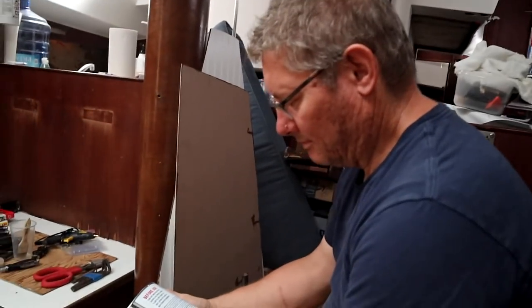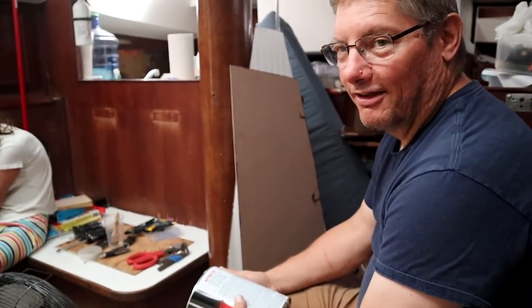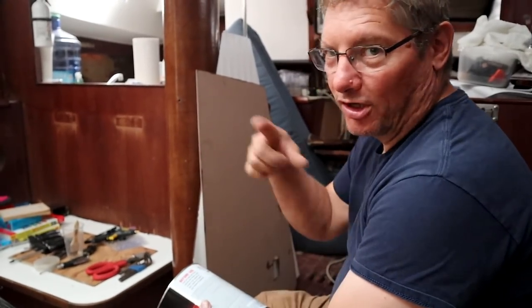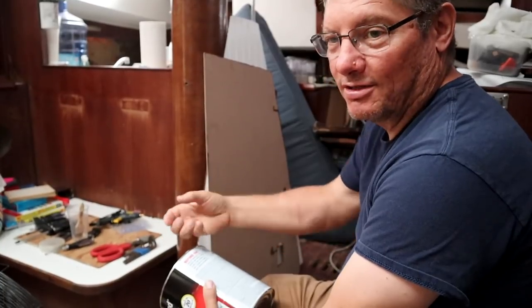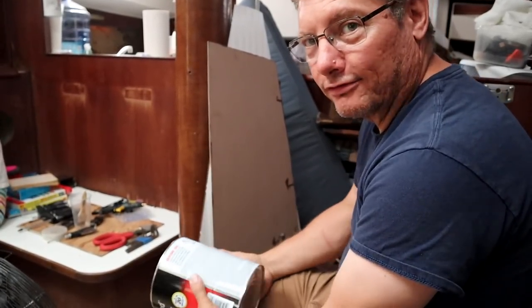But I think that if we open all the hatches and have the fans going really well, then it'll be okay. And you think? I'm concerned. Fans aren't ignition protected, which means they spark as they go around. So it doesn't matter if they're blowing air. If the concentration gets to be enough near them, they can set it off.